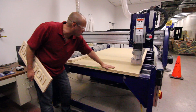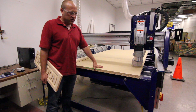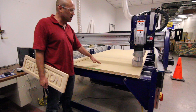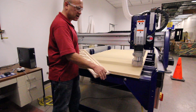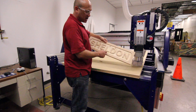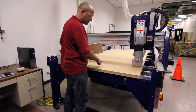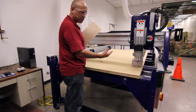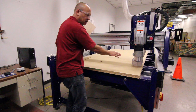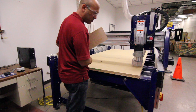Here is your working surface. If you look closely, you may recognize this material — it's just MDF three-quarter inch, four-by-eight sheet you can get from any Home Depot. It's called a spoil board because you can spoil it; in other words, you can cut into it. We take whatever we're doing, bolt it to the spoil board, and in many cases you'll cut through and into the spoil board. You can even see lines on our spoil board from past projects. As this turns to Swiss cheese, we rip it off, put a new one, and level it. The spoil board is meant to be cut into, which takes some of the pressure away so you can cut through materials.